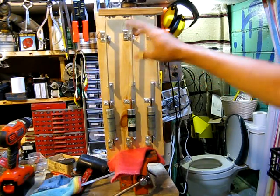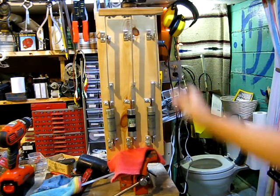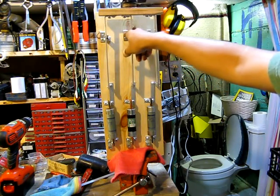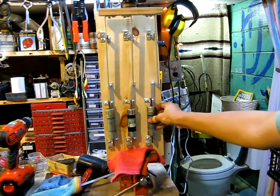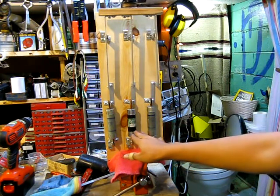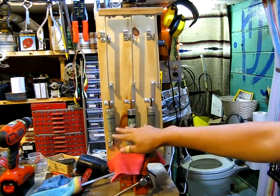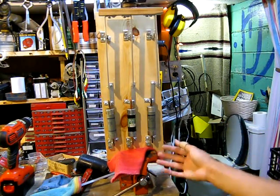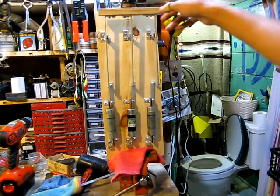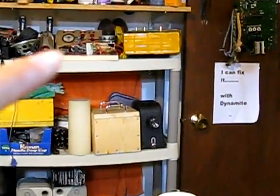Three knife blades — this is all made of aluminum. This is I think half inch and that's one quarter inch aluminum. I used mechanical lugs; real knife switches don't have that, but I did that so I could attach a wire through there. Three 100 amp fuses — this fuse cost $8.00. Back some time ago when these were bought, they were only $3.00, so there's kind of a big difference. I found these in the barn and decided to take them. The handle up here is from a vintage battery tester — it's the one used on my rocket launcher, up there with the meter.